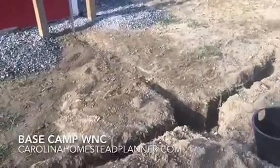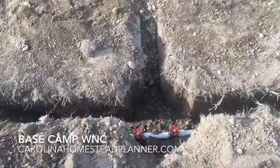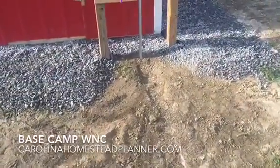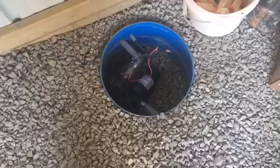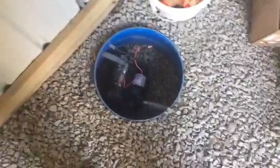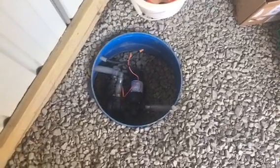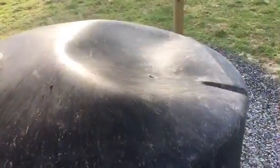This is more or less the main line. It comes down here, and right in front of the pump house we have two main valves — this one controls everything on the uphill side, this one controls everything on the downhill side. Inside the building is a 12-volt, 6-gallon-per-minute pump that pumps up to 90 pounds of pressure. We're going to see how it works on this entire system, which the owner spec'd out.